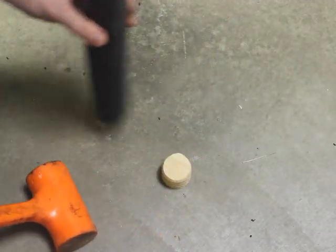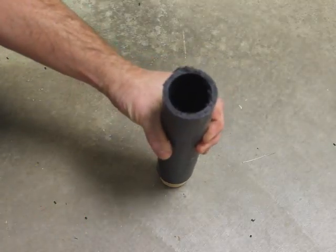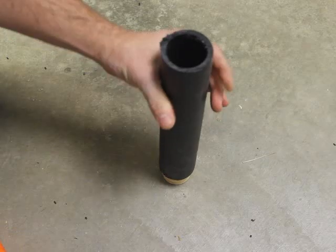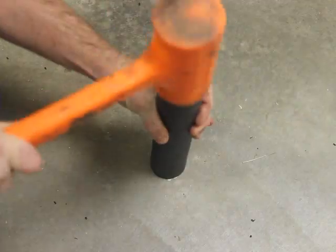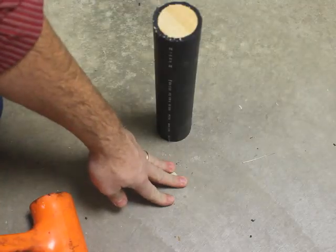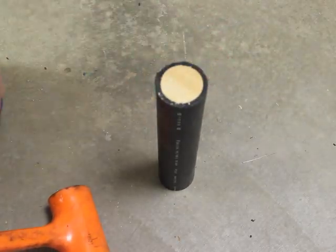So again, put the plug on the ground, take this, put it over top, and you want to use some elbow grease. I'm going to hit it pretty hard. I'm going to hold this pretty tight with my left hand — I'm right-handed — and I'm just going to hit this pretty hard because the tube just doesn't fall in by itself. So you want to have it nice and straight, get it leveled up. You'll get pretty good at it after you do a few of them. I did it in two times — stuck it in and the plug is in. It's nice because it's a good solid surface right here — this is concrete — you don't want to install it on something soft. That gives a good smack, a lot of pressure, and you can see I hit it in with two smacks.